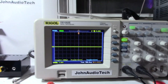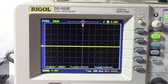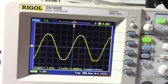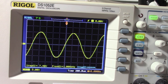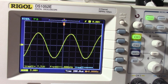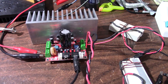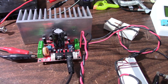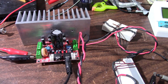Pointing the camera at the scope — here's our 1kHz sine wave. There's clipping — looks like nice symmetrical clipping with no oscillations. Taking it just out of clipping, that's 7.3 volts. So at 12 volts I'm getting 13.3 watts maximum clean power before clipping — that's actually very good. I'm going to test it at a couple more voltages and do the 2-ohm test, and I'll come back with the results at the end.